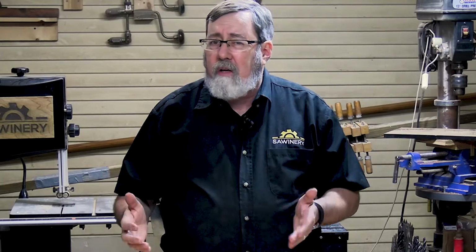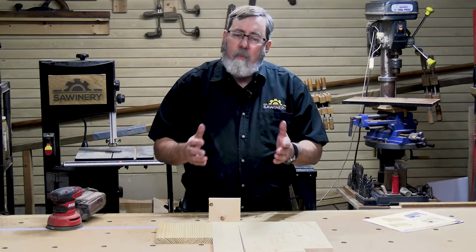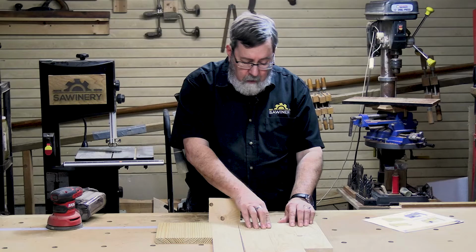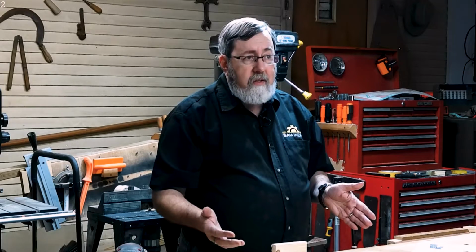So that's something we can do to get better mileage out of the lumber that's available to us. You don't necessarily have to buy premium wood. You can buy lesser grades of wood. Make sure that when you cut it up, you pick out the parts of the wood to use so that the pieces that are going to be the most visible, for example the top or the front, have fewer knot holes showing.